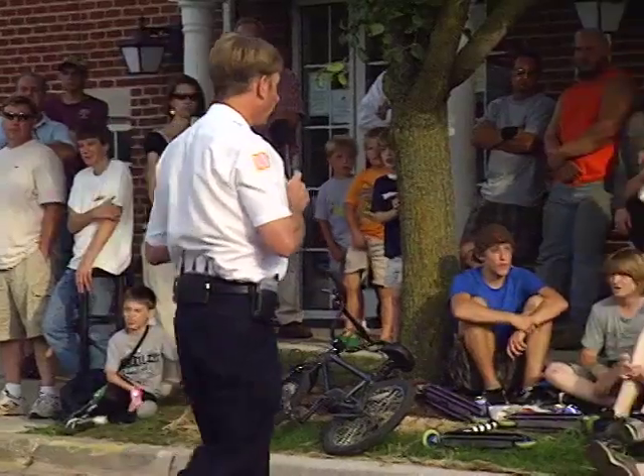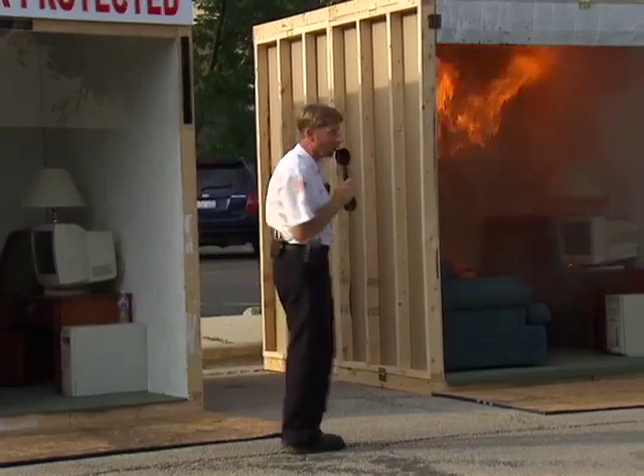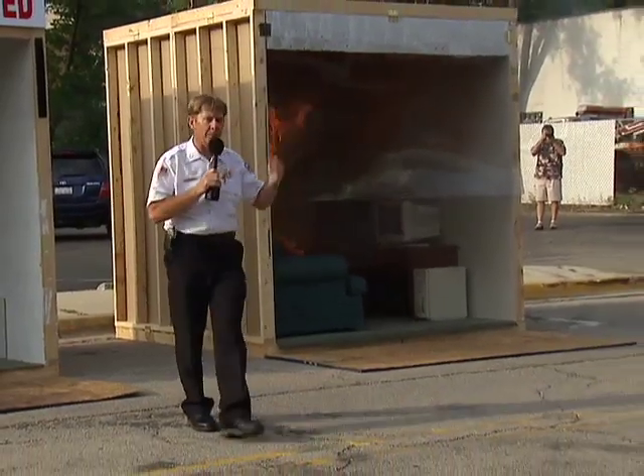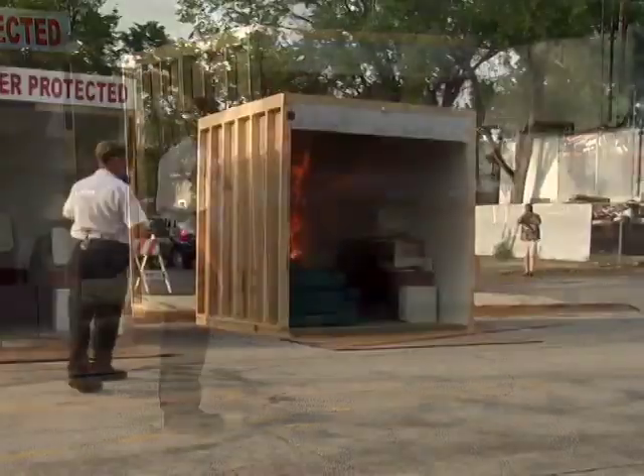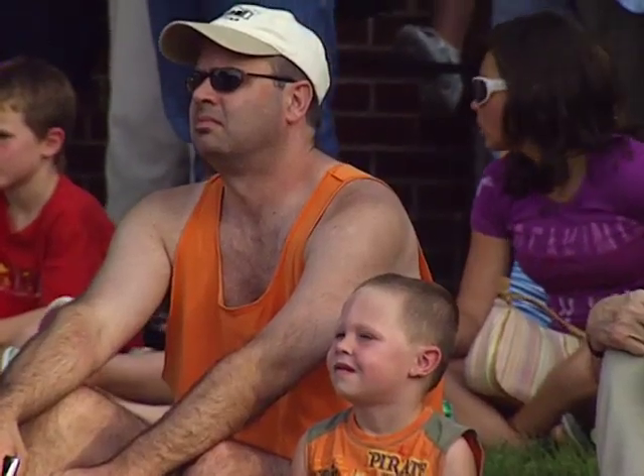Your side-by-side kit includes suggestions for presenting two types of demonstrations: one where you ignite both sides at the same time, and a second where you ignite one side at a time. Both are good educational opportunities. Let's walk through the second scenario where you burn one side at a time. Start by telling your audience what they're going to see — the power and speed of fire, as well as the life-saving effects of automatic fire sprinkler protection. Inform them that no accelerants were used and that personnel will ignite papers in a wastebasket to start the fire. Start the fire in the unprotected side. Time key events, such as when the smoke alarm signals and flashover occurs. In about 15 seconds the smoke alarm will begin to chirp. Before that happens, quickly talk about smoke alarms and having an escape plan.